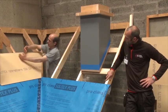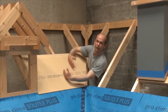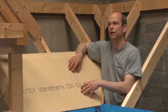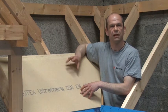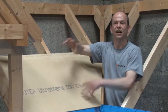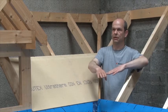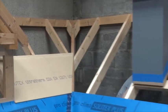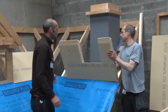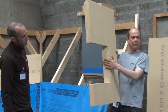The overlaps from the joints should be 300mm apart, so don't go closer than 300mm - everything at 300 is fine. There were sites where they've done a 200 square meter roof, relatively easy and straightforward, done in two days. What makes it complicated is if you have a lot of dormers, different angles, valleys, hips and so on. For areas around the chimney I do like to actually cut the angles as well, just make sure you're not leaving any gaps.